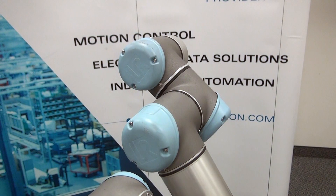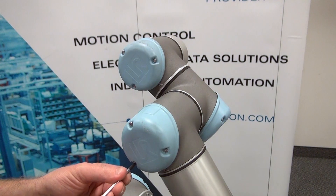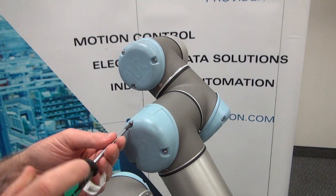To begin, we're going to imagine that this robot is powered off and will not boot up, so I'm going to show you how to manually position the robot to remove a joint. To do this we'll remove the blue cap using a Torx driver number T10. Be cautious when removing these screws because they are not captive and they will fall on you.